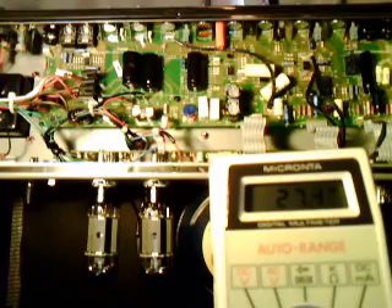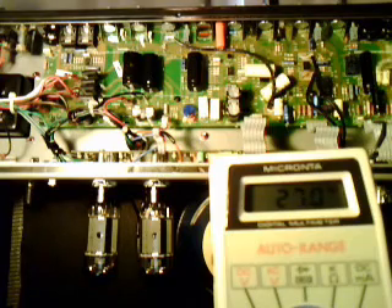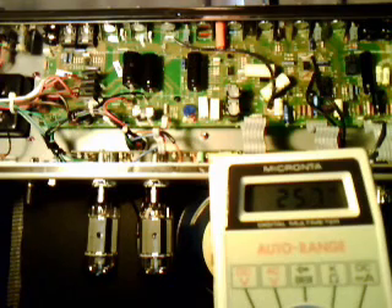What you need is a 10-watt rated, 25 kilo-ohm cement power resistor. Or you can just use what I use: 33 kilo-ohm, 5-watt rated. If you use a resistor that has too low a wattage rating, it could explode or melt or something. So if you think this is possible, wear some safety goggles so you don't put a resistor in your eye.